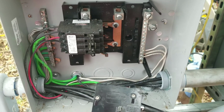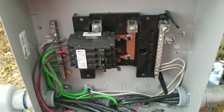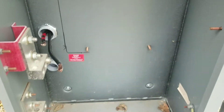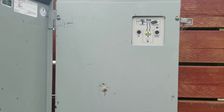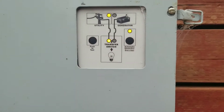I just dug into my electrical panel for my well and my shop. Last weekend I put this enclosure on it which fits a transfer switch. This conduit right here goes to this transfer switch which feeds my house. By the way, if your transfer switch is doing this — flashing — it's not a fault. All you do is push the test button and you're back in business.